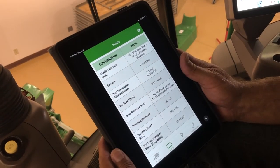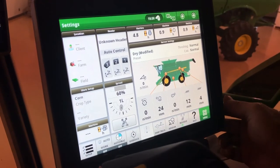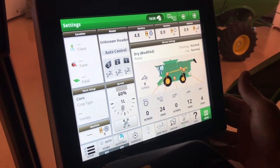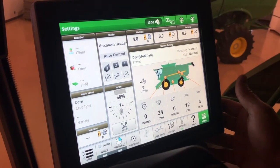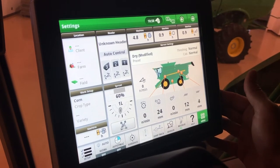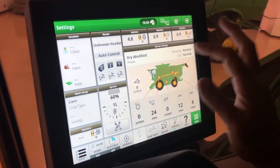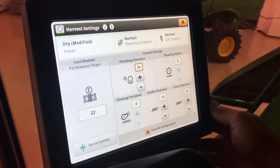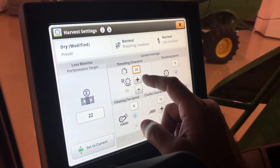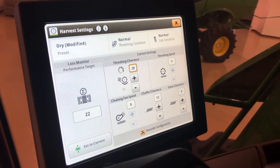It gives us all our rough settings to start out. We're going to do some recommended or approximate settings for corn. On these newer screens it works really well compared to older machines — it's as simple as touching in the middle of the home screen and it brings us right to our settings. For threshing clearance, if we want to start at around 26 or 28, simply scroll up to there.